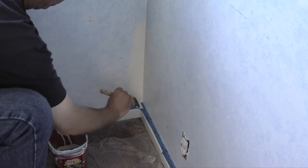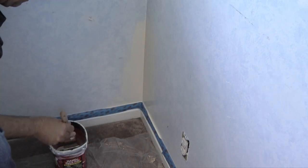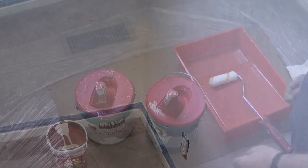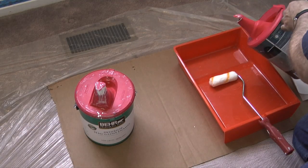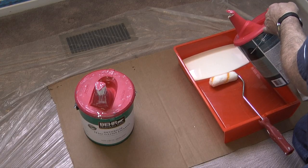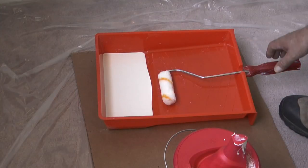I could use the paintbrush to paint the wall corners, but what I'm going to use instead is a 4-inch corner roller. I really like corner rollers. They're faster than a paintbrush, they go right into the corner and against the taped edges, and the finished painted areas look better because you don't see any brush marks.